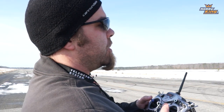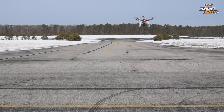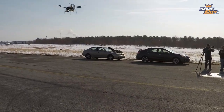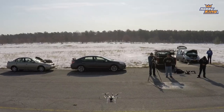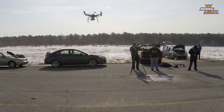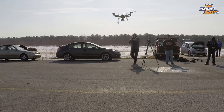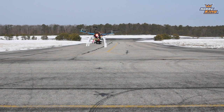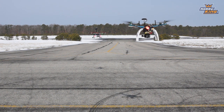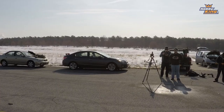Now what I'm gonna do here is show you, if I move the stick in acro, it wants to stay where I point it. And other than the fact that it's kind of a bowl-shaped copter and is a bit self-returning anyway, it wants to fly away. I put it in stabilize, as I've done now, and it much more aggressively turns to level. So bang the stick away very quickly, and it comes back to that level point.